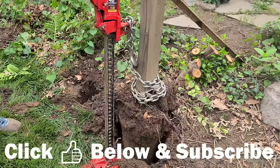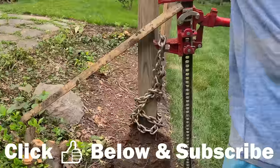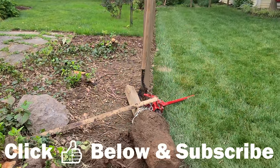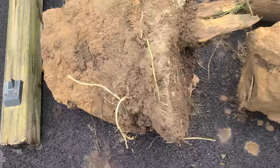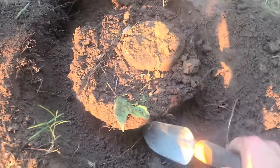If positioned correctly, you will have enough jack height to pull the fence post straight out of the ground. If the concrete clears the hole completely, you can simply push the jack and fence post over out of the hole. If your fence post is rotted out or no longer attached, or if you just have a piece of concrete you're trying to remove, a little digging is required.